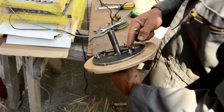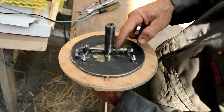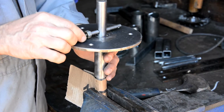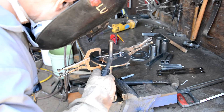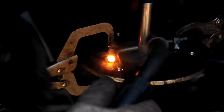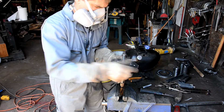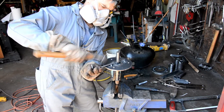And indeed, it does. I install the runner plate by connecting it to the shaft. The way I did that was I bored a hole in the shaft, then threaded a keeper pin through two nuts and welded the nuts in place. Allowing for a little bit of distortion, that makes a very tight fit for the pin through those nuts on the hole, and that tight fit holds the runner plate securely in position.